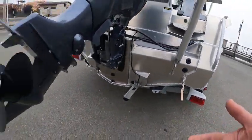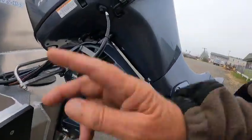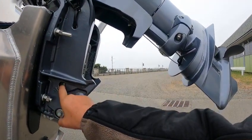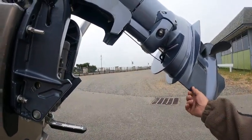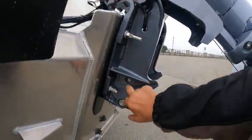Here's a little tidbit I haven't really been saying much about. Let's say your battery went dead, you were in the water, the motor was down, you had to get it back up again. Right here there's a screw. Say your trim went out — you can actually turn this counterclockwise and it releases the pressure so you can let that motor up. Get it to where it's going, put these down, and then tighten that up. This is something a lot of people don't know about.